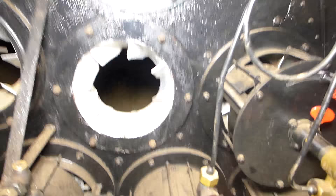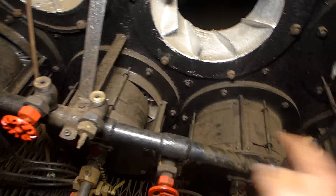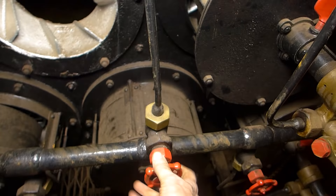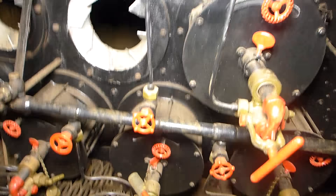To cut a boiler in, you'd open up this valve here — this is a fuel rail. Fuel oil heated at 250 degrees would circulate through this rail and actually circulate through and back out, and the unused fuel would return to the tanks. You wouldn't try to adjust fuel flow here, as that would make an almost impossible situation. So you would open the valve all the way, and you would open the damper. Whenever a burner is not being used, the air damper would be fully closed, because if you didn't, it would suck fresh, cold air into the firebox and cool down your fire, losing tremendous efficiency.